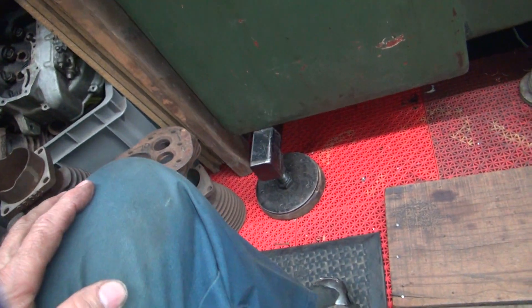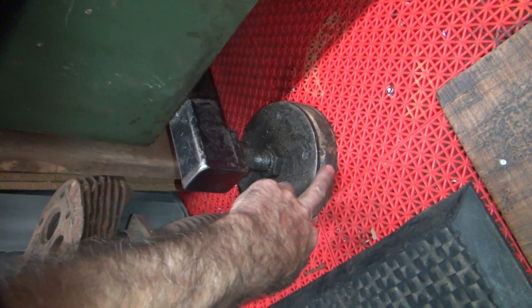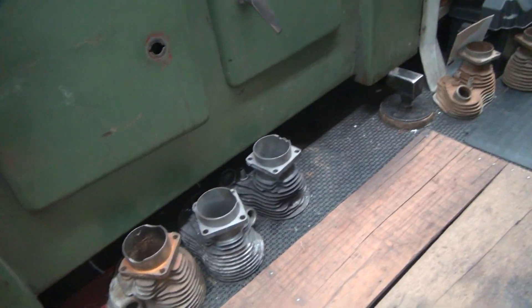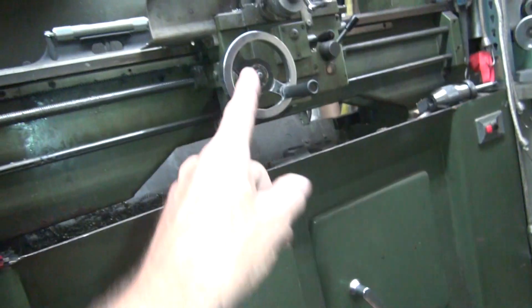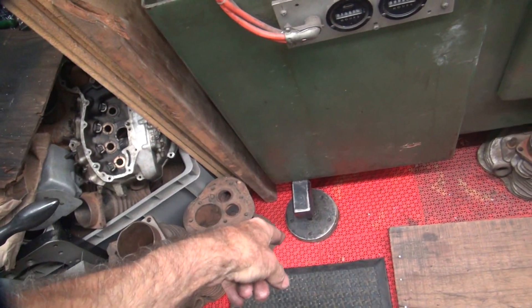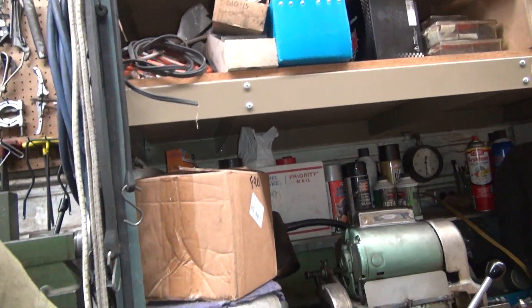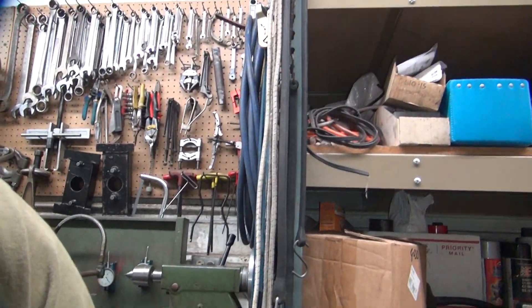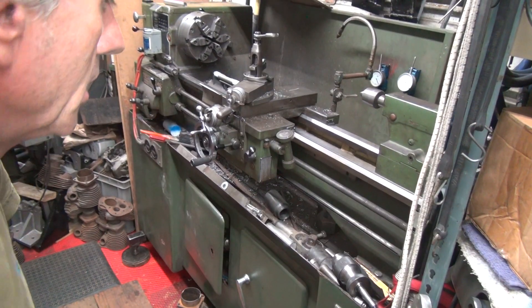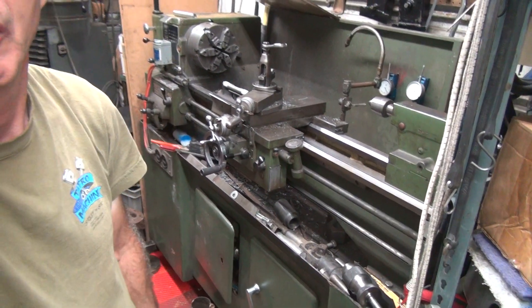On this lathe we've got the concrete floor, which has a three-degree angle for drainage. It's got these big rubber biscuits, steel plate, steel adjuster screw, steel framework holding it up - those four corners are like that. Right now this one and the other one in the back corner have all the weight on it, catty-corner, because it's got a twist in it. I'm going to try to level out the two bolts here for side to side, and then see what I can do about the twisting. I'll do a quick video to show what we're doing, then come back after I get most of it done - it might take two or three hours.